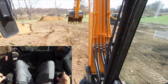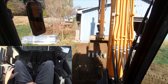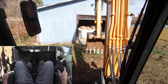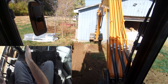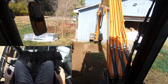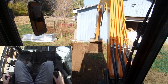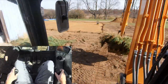It does look like that is clay — you can just barely see it up against the machine. The color difference is hard to see in the shade, but up towards the machine that is clay, so I'm going to go ahead and bump over here — I think we're deep enough. Notice here, like I was talking about earlier: I started on my edge, now that the edge is dug we're going to bump over and start digging the main part now that we've got a clean line.